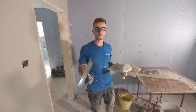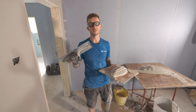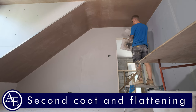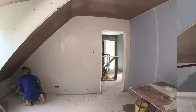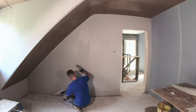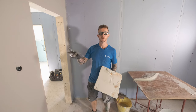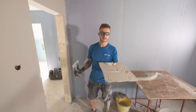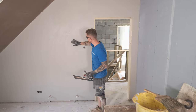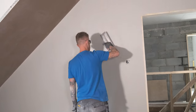I've left the material for five minutes to pick up slightly. And now I'm going to apply my second coat to one mill thickness to give us an overall thickness of two mill. My second coat is now on. I've got my exact thickness of two mill that I need for this product. I'm just going to get everything cleaned off, leave this to pick up a bit and then we can come and get it flattened. I've left the second coat enough time to pick up nicely, so I'm just leaving a very small finger mark in the wall when I touch it. I'm going to go ahead and get this flattened now.